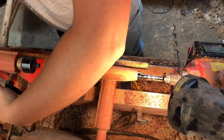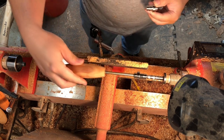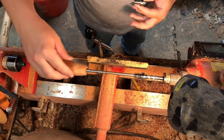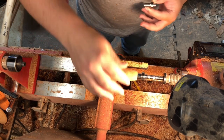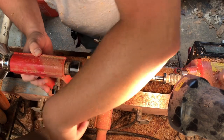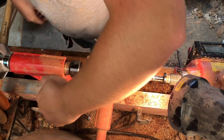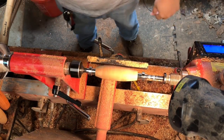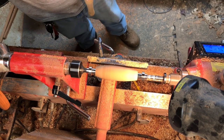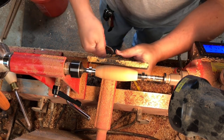To do the sanding and a little extra refinement, take the bushings and flip them around so you don't eat into them with your gouge. Get them put on there, bring the tailstock back in, lock it down, give it a little bit of pressure. Flip the lathe back on and I'm gonna take a little bit smaller spindle gouge and try to get a better surface on it before we go to sanding.